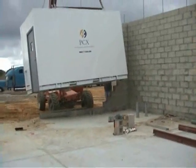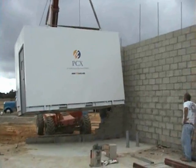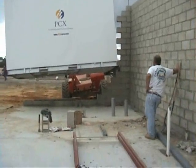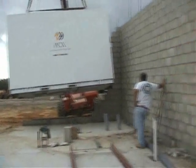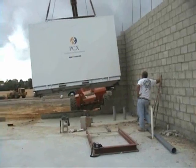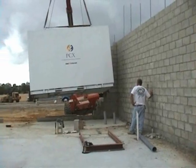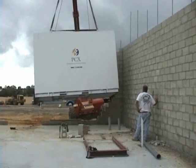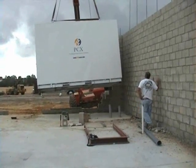We've got an optional solution where we have jacking mechanisms built into the unit, which allows the installing contractor to just set the electric room on the slab and then enter and jack up the unit on dual caster wheels. There's actually 4 sets of wheels, and then you can easily roll the room directly into position and then lower the jacks. There will be no special rigging equipment needed except the ability to take the room off of the truck with a forklift.